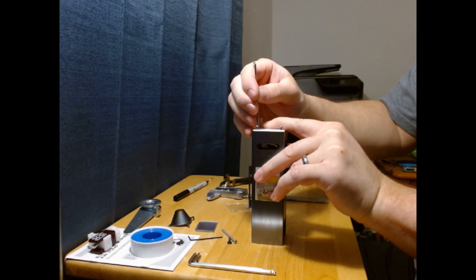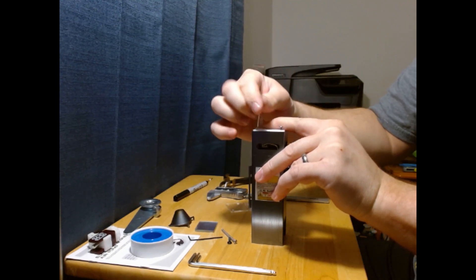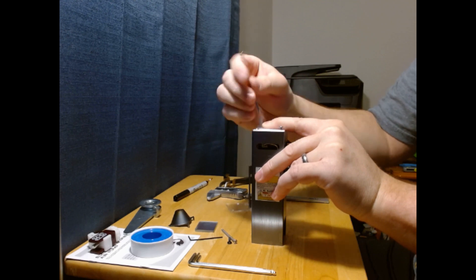We need to remove the three screws left on top and remove the top plate without allowing those little spacers to fall down. You can leave the laser engraver sitting on the table nice and flat, and as long as you pull the screws straight out and lift the cover straight up, align the new cover straight down, and refeed the screws back in straight down, they shouldn't go anywhere. But if the thing falls over while you're doing this, it's going to be a bad day — you'll have to take it completely apart and reinstall everything upside down.